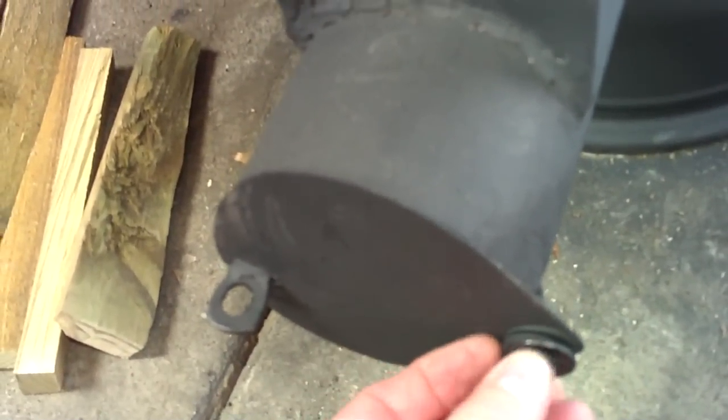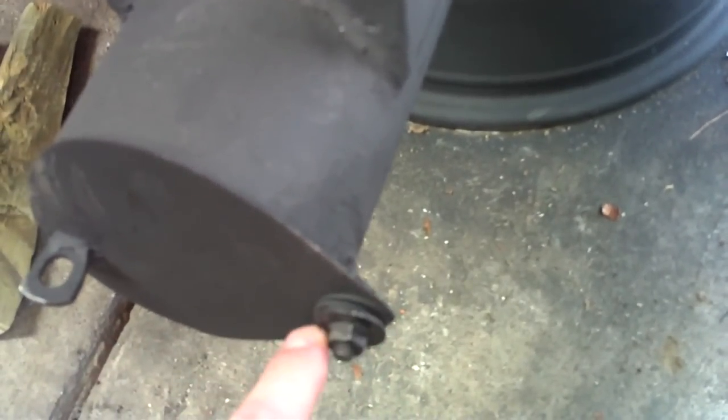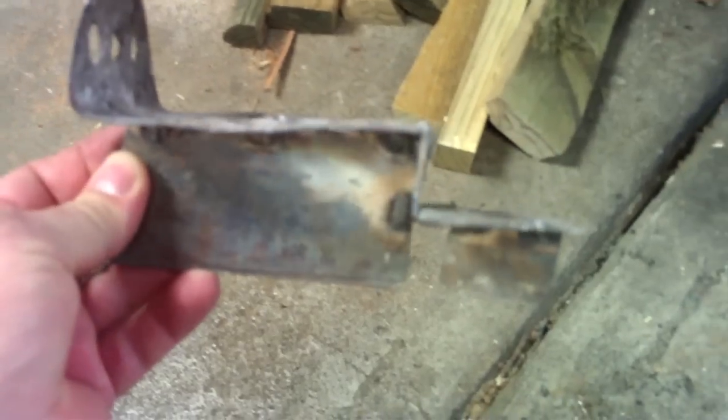In the front I did a sliding door. I had a magnet on it before, but after heating it up a few times the magnet didn't work too well, so I just put a spring and a couple washers in so you can slide it out of the way. I also did a little stainless steel grate to feed my pellets and wood, which is kind of why it's stepped a little bit like that.